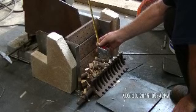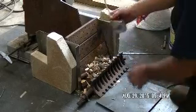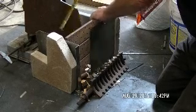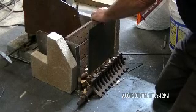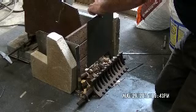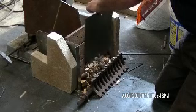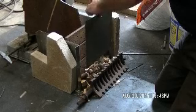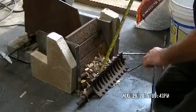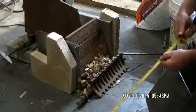With a multitude of different fuels, I'll be able to use sawdust and chunks of dried wood and so forth. This plate will be dangling in there, so there's going to be a triangle effect — the sawdust comes down through the hole in the top, and this plate will float back and forth as the sawdust pushes against one side and burns down. It'll keep moving back and forth to prevent bridging. Every so often I'll give the shaker grate on the bottom a little turn to take out accumulated ash.